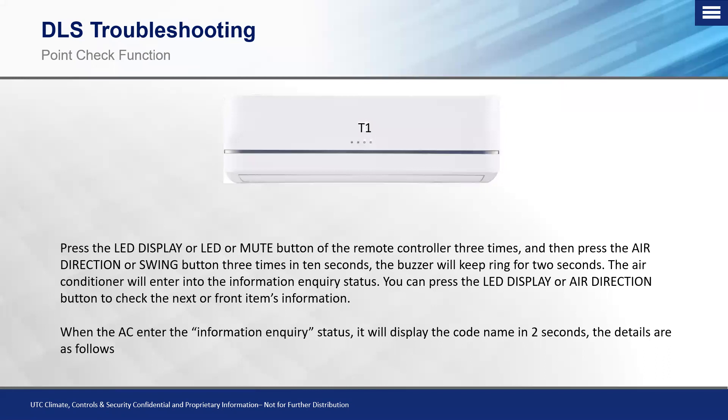There's also a menu to navigate for additional information depending on whether you're doing maintenance or troubleshooting. One critical note: all temperature readouts display in Celsius. If T1 shows 25, that is 25°C, not 25°F — always convert. For any thermistor, plus or minus two degrees is the acceptable tolerance. Anything outside that range warrants replacing the thermistor.